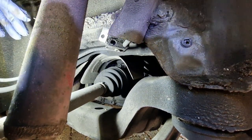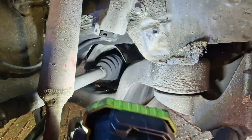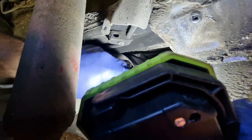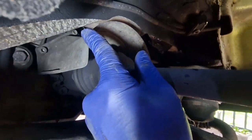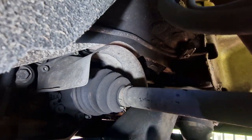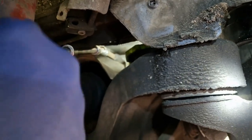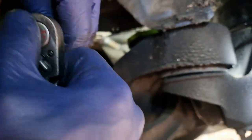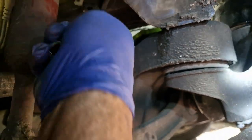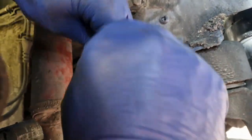First I'm going to remove this plate — if you see this plate here, this is the drive shaft guard. There's one of the Allen key bolts just down the bottom, another one there, and another one just down there. I've got to undo all three of them and take that plate off. I'm going to undo that Allen key bolt — it's a 6mm Allen key. Make sure that's in there properly. It's an awkward place but with a flexi bit on the end.